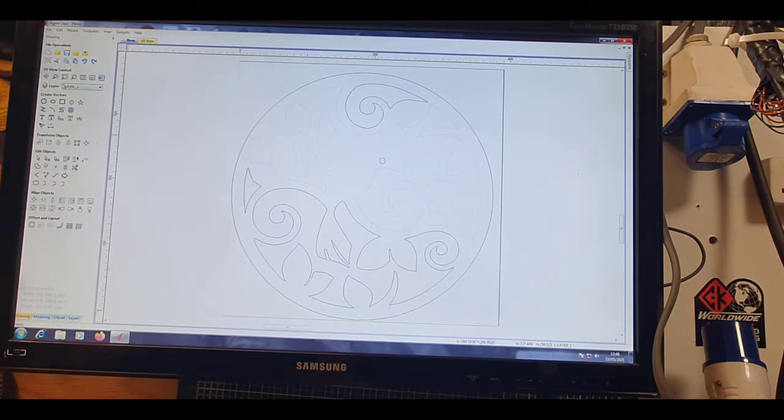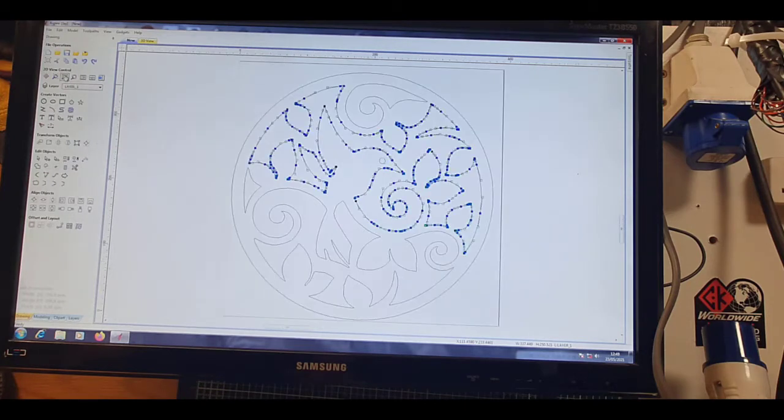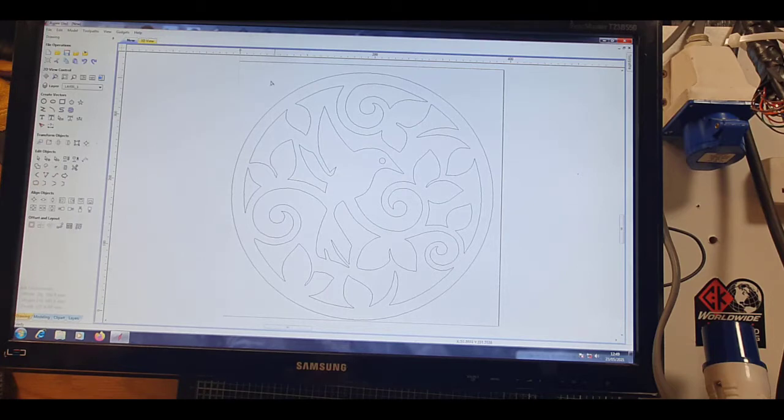I'll show you. So if we zoom in, for example this bit here, it highlights straight away the part that you wish to edit, and as you can see, there's a lot fewer nodes there. There's thousands on a DXF, so you can delete them. Pretty much I get rid of all the black nodes, which are basically tight corners, and I make them all smooth, and that way it just looks like a far better cut for me. So that's how I go about it. Let me just click on that one. So once we've got them all like that,